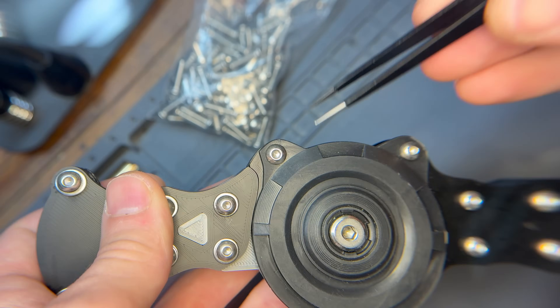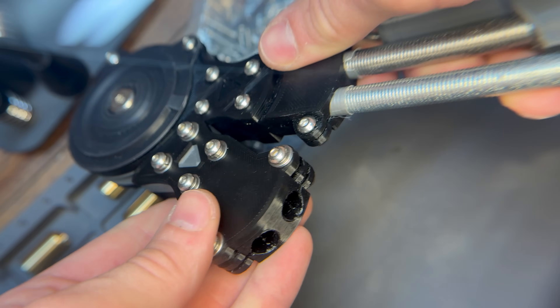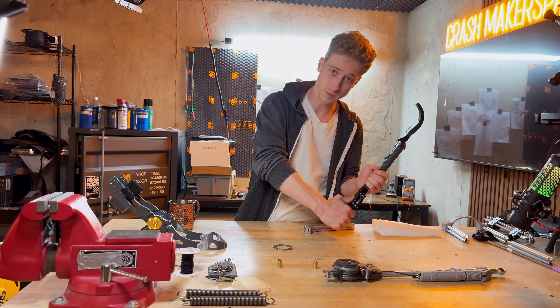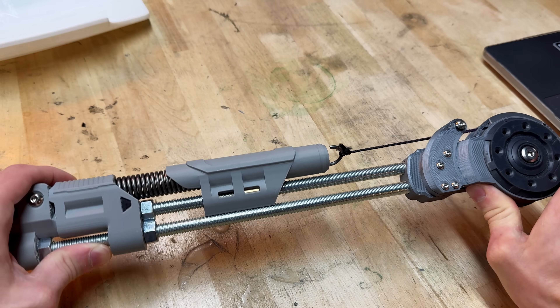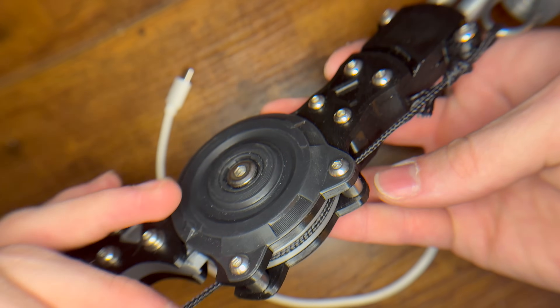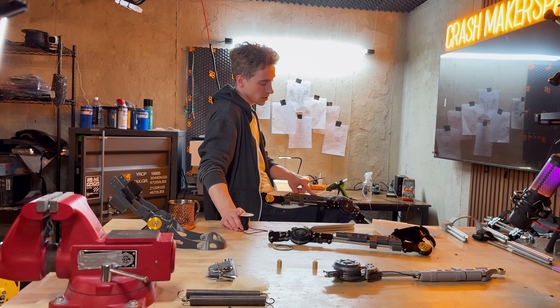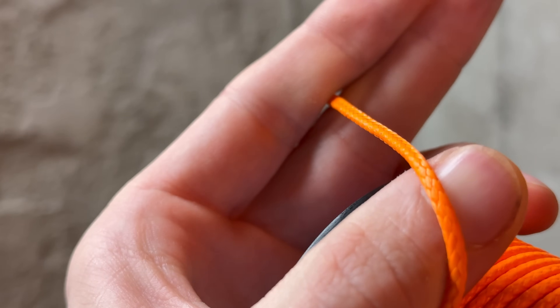This hinge has a more organic look with interfacing for the 150-degree and zero-degree backstops. The best way to design a strong stop is to have as much surface area and contact points as possible. I also have two bolts that prevent it from splaying apart, with bushings to guide the tensioner cable — which runs up to the extension piston. I'm using Kevlar cord rated up to 600 pounds of tension — abrasion resistant and takes high heat. The only problem is it's pretty slippery, so knots loosen up over time. I've ordered Dyneema cord, which has zero elongation and no creep, so it should perform much better.